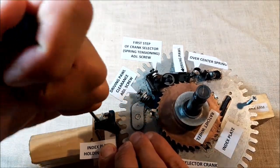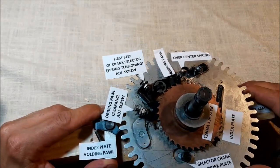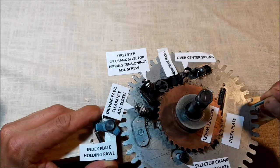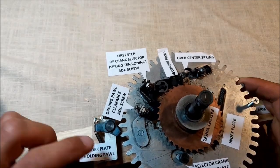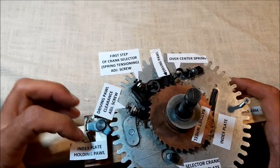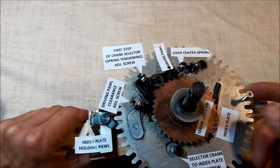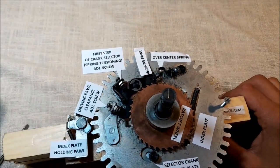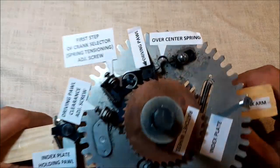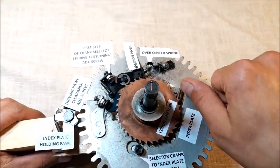Once the pawl is here and it's touching the gear, have a look. With the lock arm released, you may try on any other positions, and any time you lock the arm it will slide smoothly into the gap of the index plate holding pawl, because the whole index plate will be pushed back for no clearance here by the spring. Okay, so there is no more adjustment you have to do with the index plate holding pawl, despite there's a lot about it in the manual. Okay, so once you have it done, we may release that